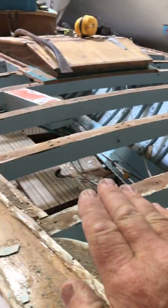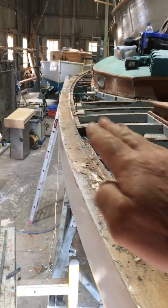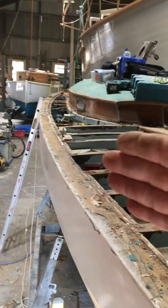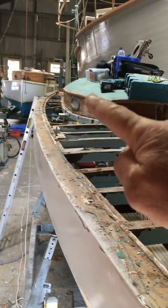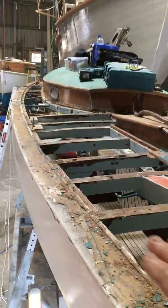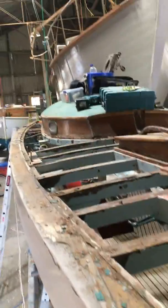The deck beams up the front here look to be good, but then as we go down the side you can see where the carling is broken down the side of the coach. The sides have all slumped away, and so the boat has lost its shear in its deck.